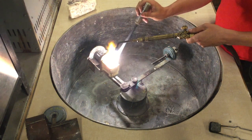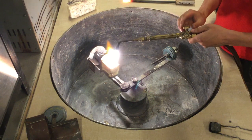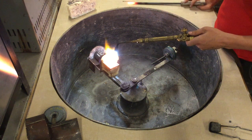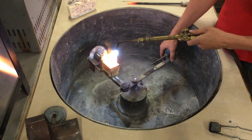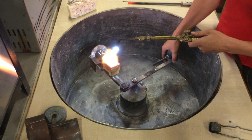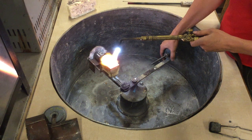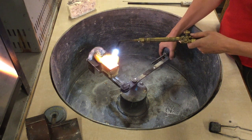This is the tricky part. You've got your cover flame on, your metal is fully reduced, you're ready to cast, and now you have to set down your stirring rod. Everything is ready to go — set down your stirring rod and grab the arm. There is a lot of spring force on this arm, so you're going to pull it towards yourself — clockwise in this case — and wait to hear that pin drop. If the pin doesn't drop, you need to bump it with the arm or have an assistant help. Then when you're ready, count to three, yell 'casting,' and let it go. Three, two, one — casting.